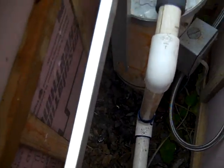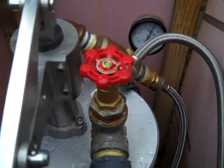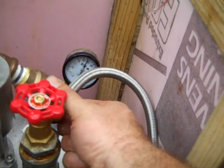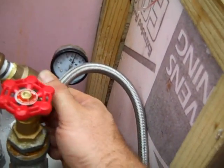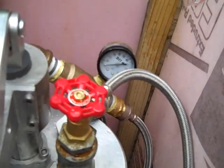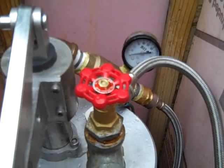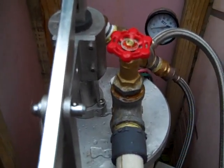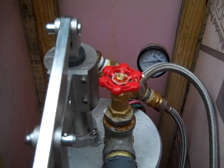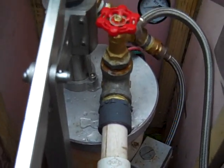We've left the handle on the pump slid down pretty close to where the spigot is. You back-feed your house from here — there's a pressure gauge to tell you how you're doing. The pressure bleeds back down to zero via a check valve, so both your submersible and your simple pump can be on at the same time. If the power goes out, you just come out here, turn the spigot on, start pumping, and you can get a lot of good potable water that way.